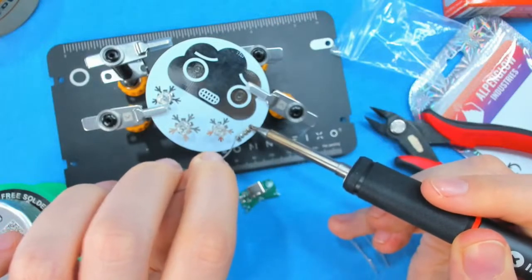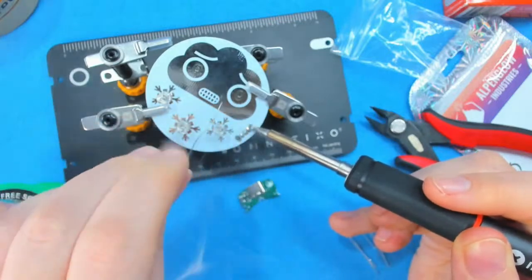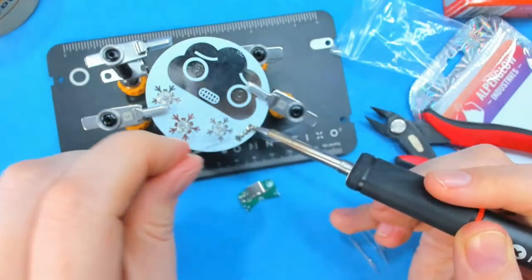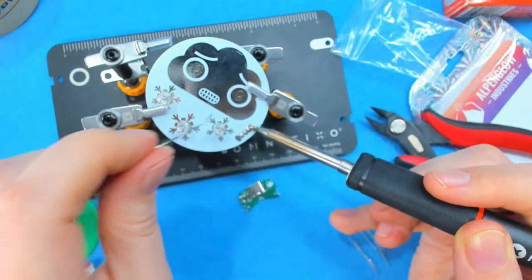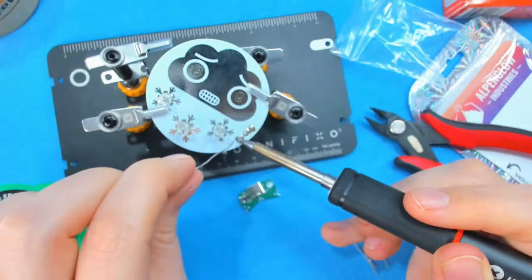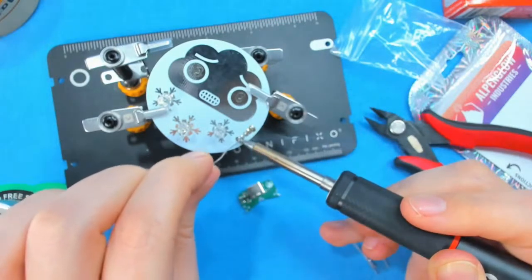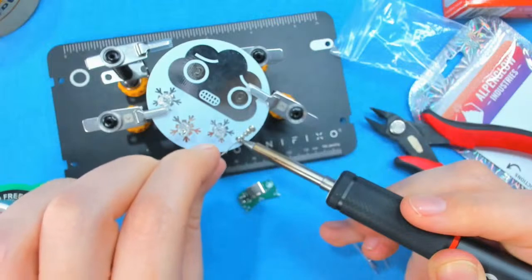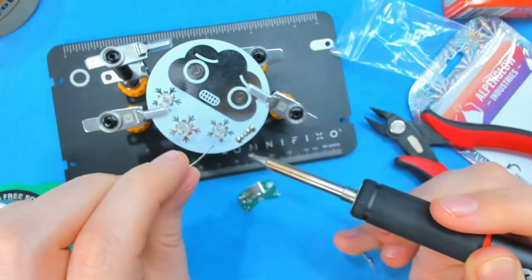Come on. Are you a ground pin? You're probably a ground pin. You're eating up everything. Adding more solder for more thermal contact. There we go. Again, this is a little easier with leaded solder, but I prefer lead-free for a lot of different reasons, which I will be happy to share. There are some really good articles that have covered it. Letting this sort of melt through.